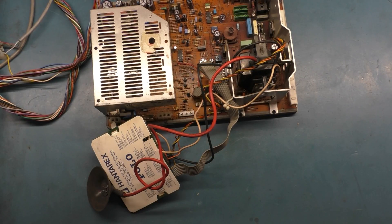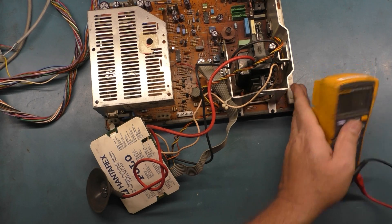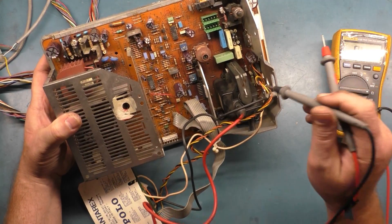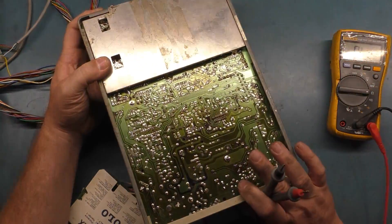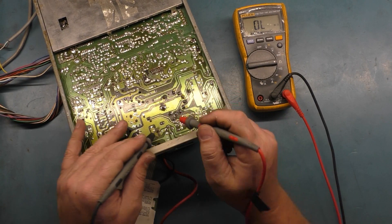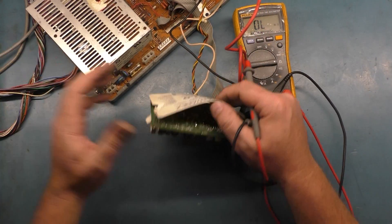We're on the bench here again. R234 is down in here next to the flyback, so we'll have to grab it on the bottom side, right here. We should have 10 ohms for R234 — and we get 10.1. Okay, so now we go to R40 on the neckboard.